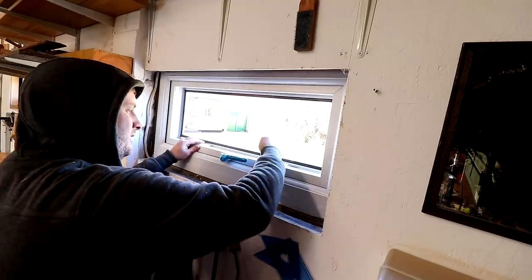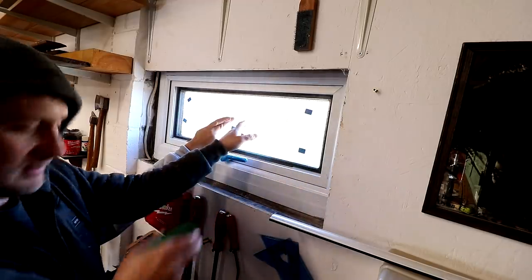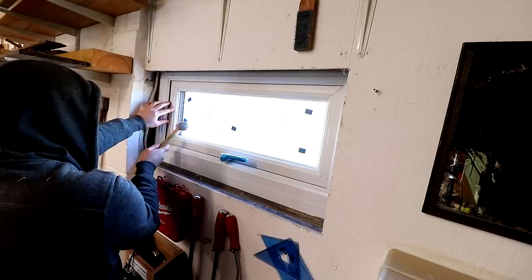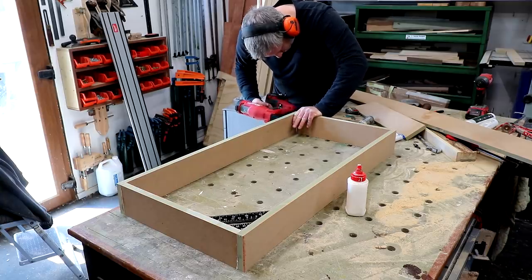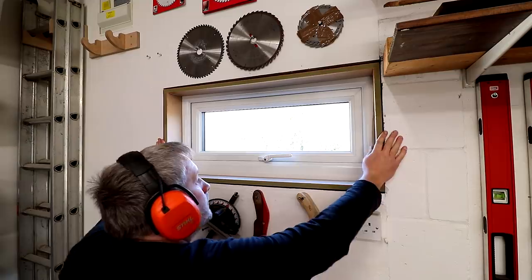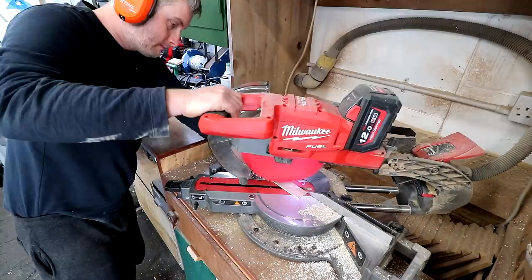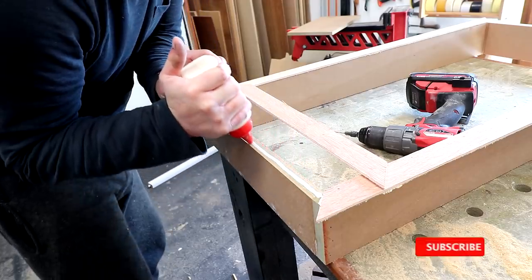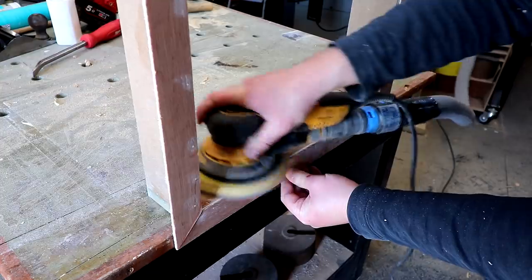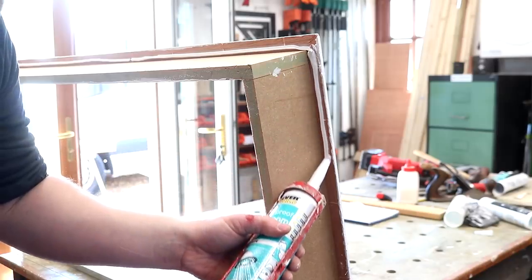You get a couple of plastic clips that push in place for the glass to sit on, and then the glazed unit can be installed. Spraying a bit of soapy water onto the glass makes it much easier to fit the beads in place that will hold the glass. A couple of days later I made up some window boxes using some scraps of moisture resistant MDF - these are similar in construction to what we did recently on the van conversion project. This box fits into the opening nicely, and then I can rip down some thin pieces of plywood to make a mitered frame which I can pin to the front edge of the box.